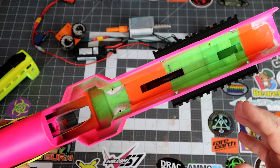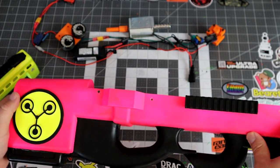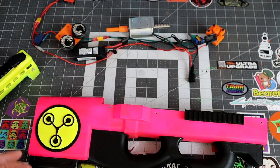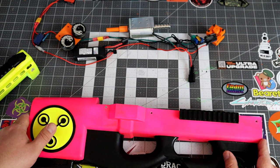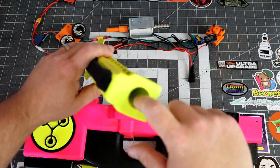It just seems like you get way better accuracy depending on the flywheel system. And if you need it to shoot straight, you might as well look at the alignment of the flywheels and just make sure everything's aligned straight. The barrel doesn't seem like it really helps too much in that regard. So that's why I went with the wide tube.